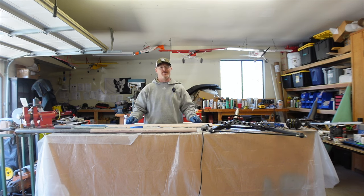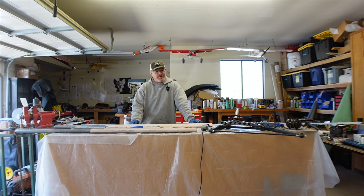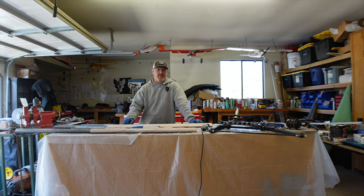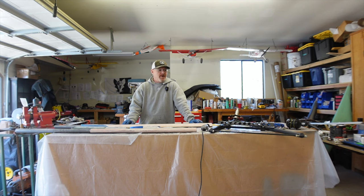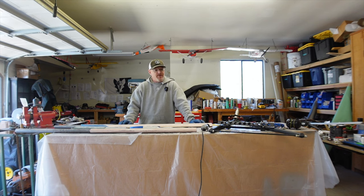And really, that's always my target, is to see three numbers up there, not two. I want to see 100 miles per hour at a reasonable cruise setting. So that's the goal with all this, is when it goes back on with this gear, which I want to put back on to test the big wing, that I hopefully will maintain that 100 mile per hour. With this on, without any fairings, before you guys saw, without the fairings on the wing struts, it was 96. Just with the wing strut fairings, I might already be there. So this can't hurt. You know, that's really what it boils down to.